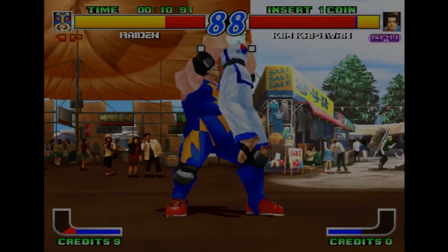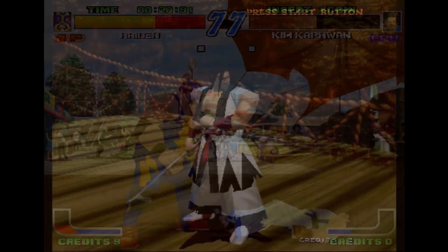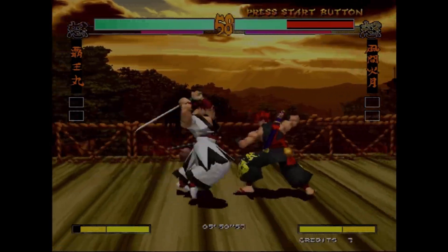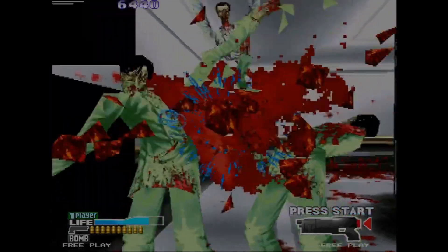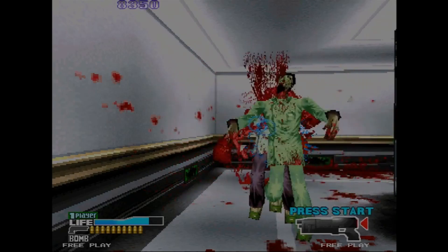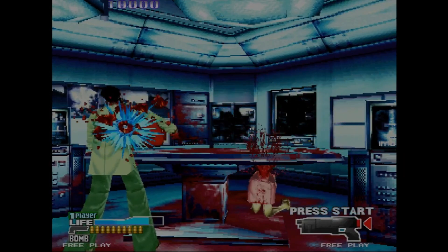I keep coming back to the Nintendo 64 core to show that a CPU running seven megahertz slower at stock — and faster on the turbo core — is possible on MiSTer FPGA. Because the Nintendo 64 system bus and RAM is larger and faster than the Hyper Neo Geo 64's, we know we're okay there as well. The big heavy lift would be reverse engineering the custom 2D and 3D chips on the Hyper Neo Geo 64 motherboard — it might require deliding them and scanning. I'm not saying it's going to be 100% possible, but this thing has one of my favorite arcade libraries of all time. Sure, it absolutely failed as an arcade board — it could not compete with what Sega and Namco were doing in arcades — but these games have charm and are an absolute ton of fun.